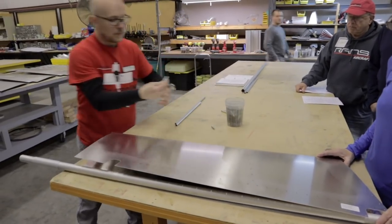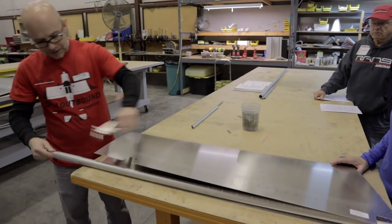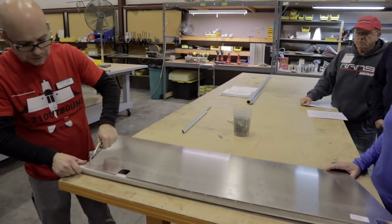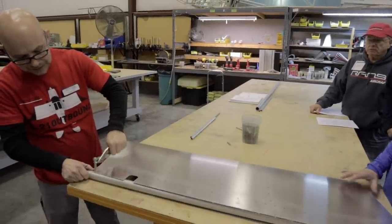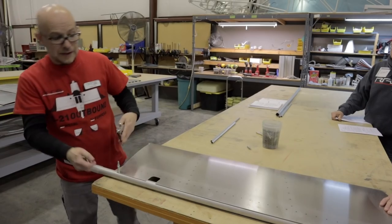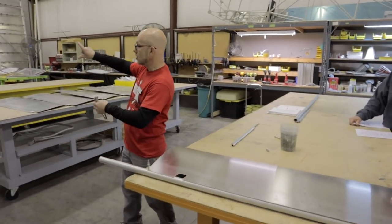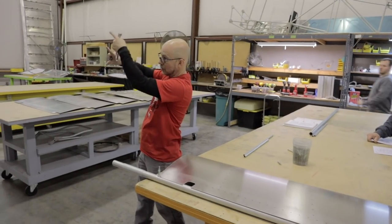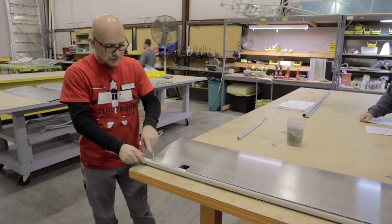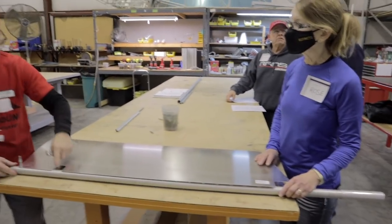So we're going to purchase a piece of PVC and then it'll tell you the diameter. Yes, you'll mark a center line along it. Yep. And then use this actual piece to go ahead and drill it. Yes, you can use it as a guide to drill it. Do you mark it first? I do like to mark it. I'll take it to a doorway, it's the best way. Put it in the door jamb, and use the corner or a piece of angle. Mark your center line just so you get at least this hole and that hole perfectly centered. If you get those, there's no reason these should not be.